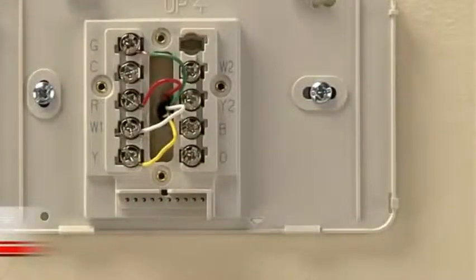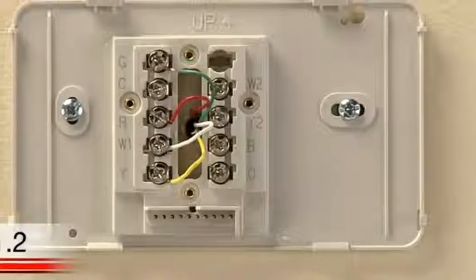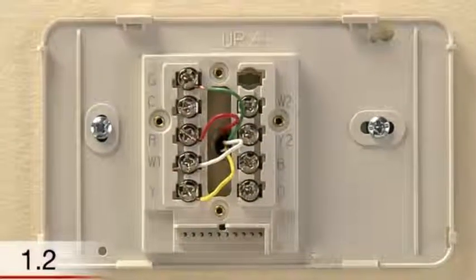This video will help you install your thermostat if you do not have a wire labeled C, but you do have a gas, oil, or propane conventional forced air system, and a wire labeled G. If you use this option, the G wire will be substituted for your C wire at both your thermostat and heating and cooling system, which will remove your ability to turn your system fan on. However, the fan will still run when your system runs. Please refer to your local building code before using this wiring option.